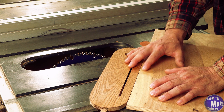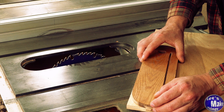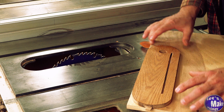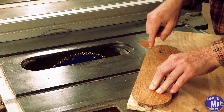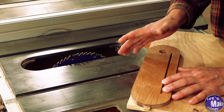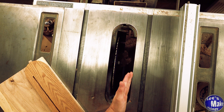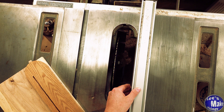Normally what people do is stick their old insert onto the new plate, trace around it, cut it out, and go from there. But I'm going to do it a little differently, and you'll see why in a bit. With the insert out, I'm going to set my fence so it's right on the edge of my insert — it really needs to be exactly on that line.